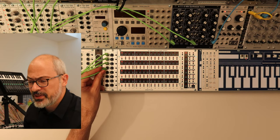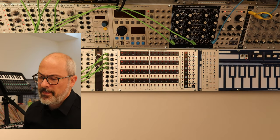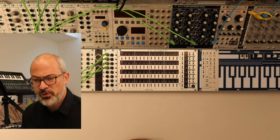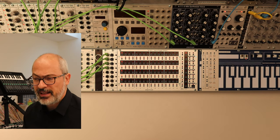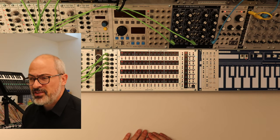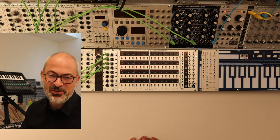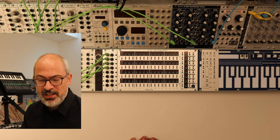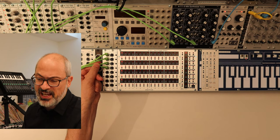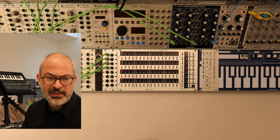Track number four is a special track — it's the accent of track number three, the bass drum. It's also possible to output the accent on only one track by changing the voltage, so the accented output will have a higher voltage — for instance, 10 instead of 5. But this depends on the modules. Some modules allow this higher voltage accent mode. Other modules, like most from Tip-Top, do not — they have an additional accent input, so you need two tracks to accent that instrument.